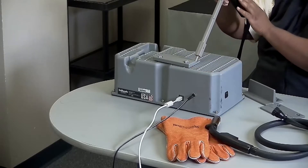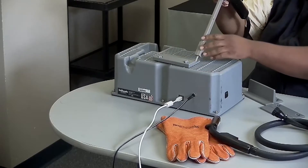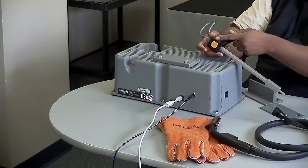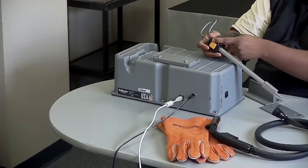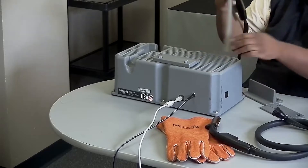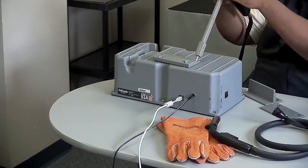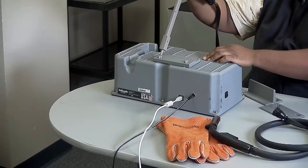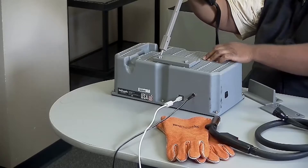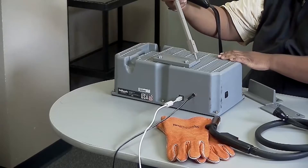So that way, the handle, the stick, and the coupon form a parallel line with each other. Then, once you've got it in position, you want to hit this yellow button here to signal that you're in the correct position, and then the system will tack or calibrate itself at that point. Put it in the position, push the button, then it'll move over to the other side — move over there, once again go to the correct angle, and also have it parallel with the end of that coupon, and push the button up top again, at which point you'll then be able to start welding.